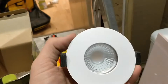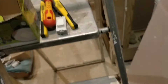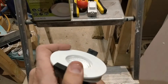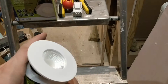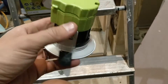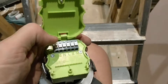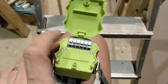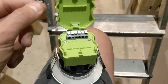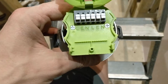I've already taken the wrapping off this one, but you can take the bevel off if you want, or it tightens in place — there's a little lug in there. When you put this on and give it a twist, it tightens in place and won't fall off. It's got a rubber gasket here which helps seal it for air. Then there's a little ratchet on the sides — when you close that and squeeze it shut it will grab. You press them to release, but you can just push the cable in and it will accept and lock it tight. This bit grips the cable and then it screws down as well — live, earth, neutral, in and out. It's honestly a dream to put in.